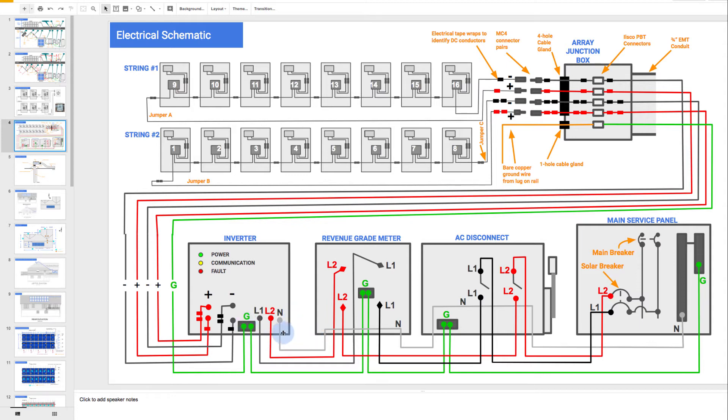There's also a ground wire. So these four wires on the AC side are going to be pulled out and run in conduit right over here next door to a revenue grade meter. I have a separate video on that as well. The point is that it's going to count the amount of AC electricity that the inverter outputs. It's a one-way meter — not both ways, just one way. Notice that the wiring comes in from the inverter on the top; that's important. We're going to put those wires in on the top, they flow through the meter and out of the bottom, counting continuously the AC kilowatt hours that you make. The neutral wire just goes straight through — it doesn't land inside the revenue grade meter.